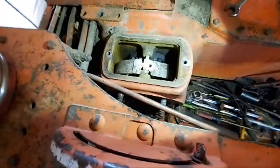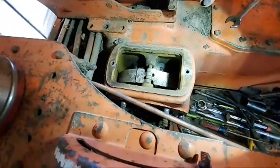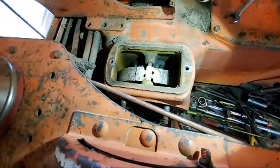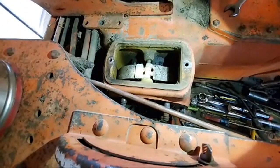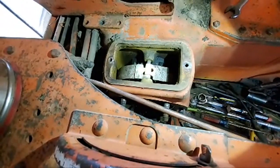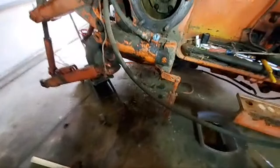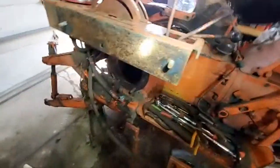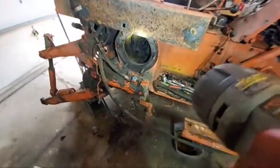I wouldn't suggest going to get chinesium from your local hardware store. Go to your local machine shop and get at least 1045 tool steel to put on there. Well, I've used it in the past and it's always worked. I had a pin for that side from the last project left over, and parts are coming today, and I'll have a pin for that side.